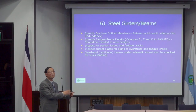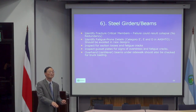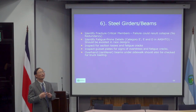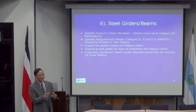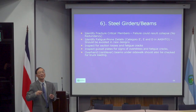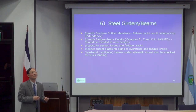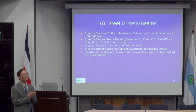And then you have newly applied concrete. Of course, for a concrete deck we don't usually use shotcrete, but regular concrete, although high strength. This new concrete has no chloride content, so it will develop a differential, basically a voltage, if you will. The voltage differential develops a mini circuit that may corrode the existing rebar in contact with the old concrete more than the new concrete. So people find that it accelerates the corrosion of the rebar in contact with old concrete at the boundary areas.